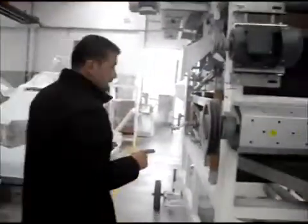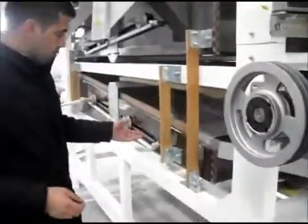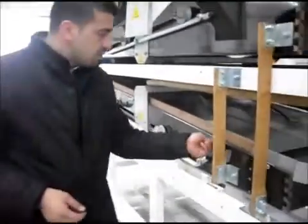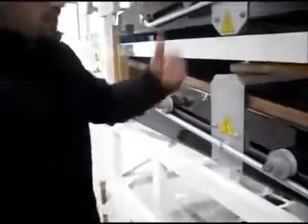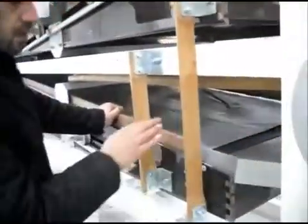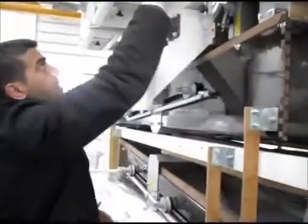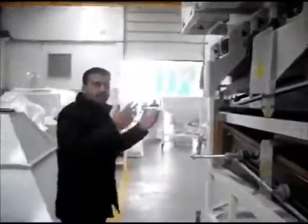Now, spare parts, screen-wise, how to change screens. Due to the brush system, you can change your screen by undoing these bolts, 3 on this side, 3 on this side, and 3 on the other side. You remove this wood and you take your screen out from this end through this space. This screen from the side, and the other top one from the front again. Of course, you receive stairs to be able to reach and see what is going on in your machine.